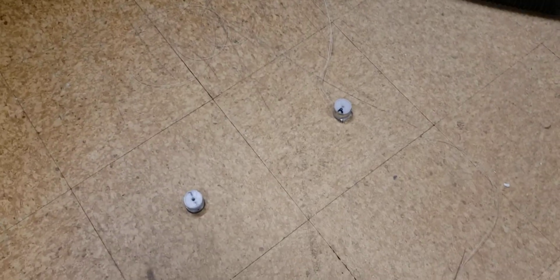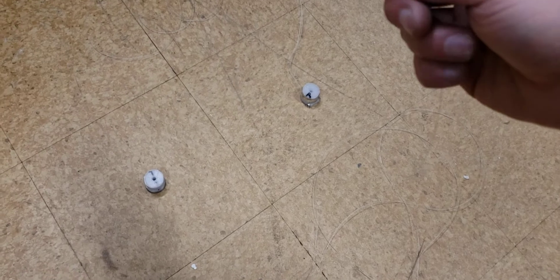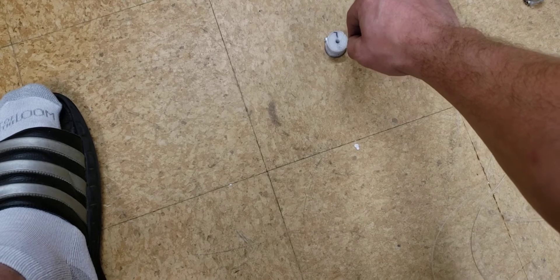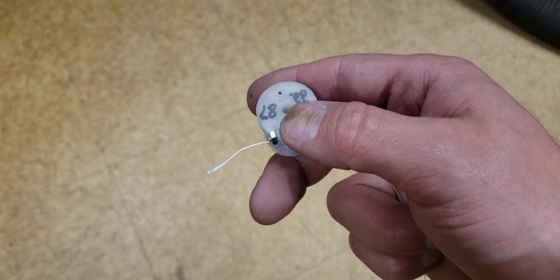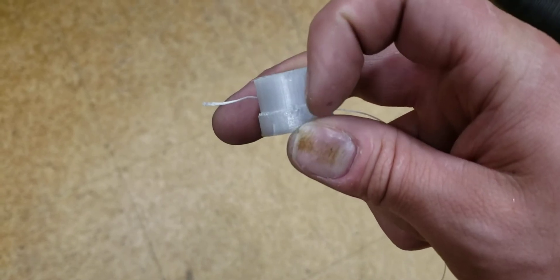Find the short side, find the mark — which is right there — and just pull it through until you find the end. From the mark, one side is shorter. Take that short side and go all the way through the spool. You basically just want to thread it all the way through — you can see right through that spool. Go all the way through so that the black line is in the center of the spool, and then lace your short end back up through that angled hole there, and it comes out right here. That's the bottom short side.